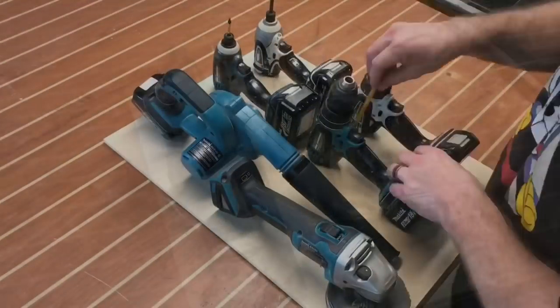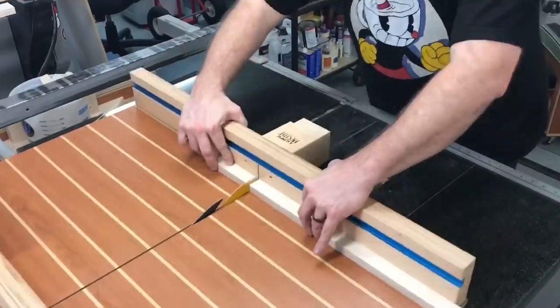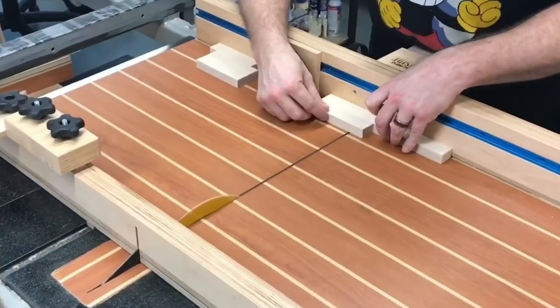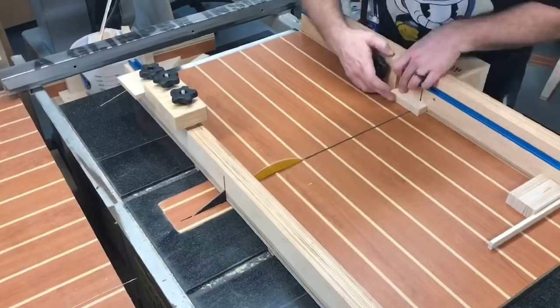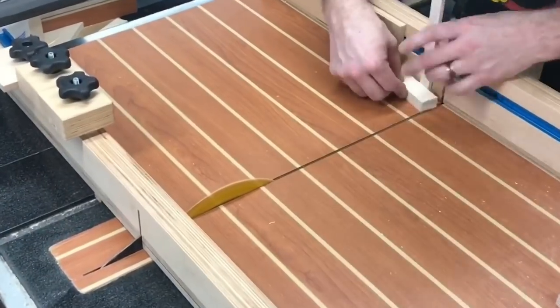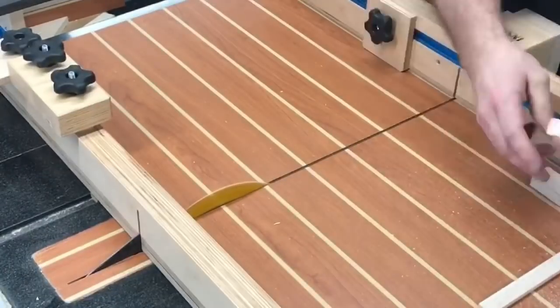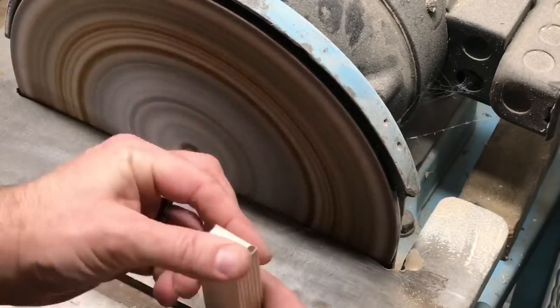What you see here, I've got a piece of plywood laid out. I'm making a few marks where I think the best position is to lay some strips that are going to actually support all of these cordless tools. The backerboard was 3/8ths of an inch and these pieces are 3/4 inch ply. On the crosscut sled, I'm angling one side to give me an angle of about 10 degrees upwards for each of the arms that's going to stick out to support the tools.